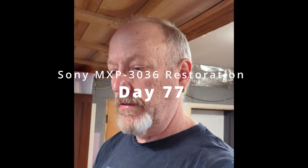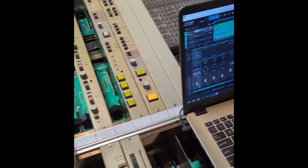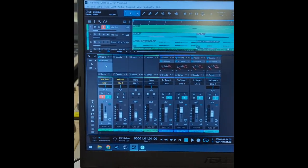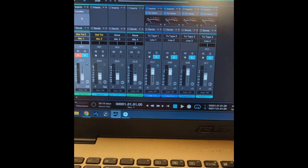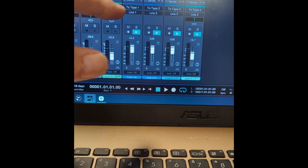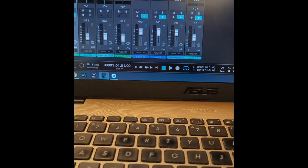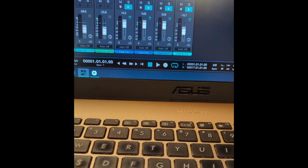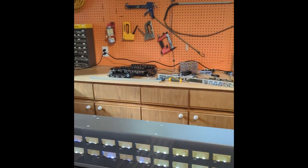Console update: I've got four working channel strips and four working faders. I've got Studio One set up with four instrument tracks — just loops — going through to mic inputs one through four, coming back from the console. The line out — I'm calling it tape one, two, three, and four — comes to separate tracks, going into the line inputs on each strip and playing back through the console strips. I've got the levels down fairly low because I'm driving these like mic signals but they're actually line level. I just have input monitoring on the returns, so if I press play I get sound coming through.